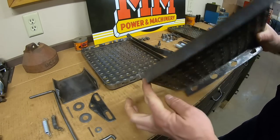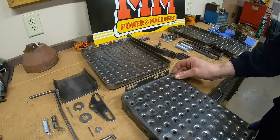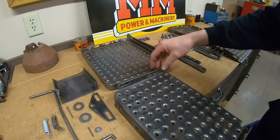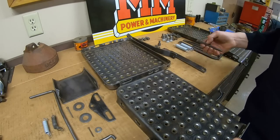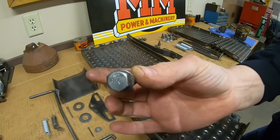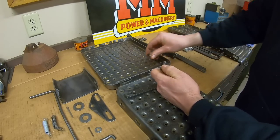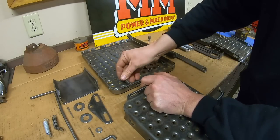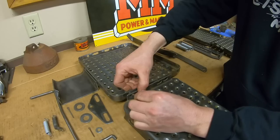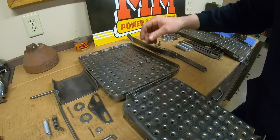The rear one has a cutout for the back corner — we'll have it upside down, cut out to the outside. These two sides are assembled with different spacing in and out because of the features on the side of that transmission case. We're going heavily by witness marks here. We've got the spacer that goes in between, and we're running an all Rockford bolt crew — no substandard hardware. Everything is just going to go together hand tight for now. You don't finalize anything until you've finalized everything — until everything has been started, nothing gets tightened down.